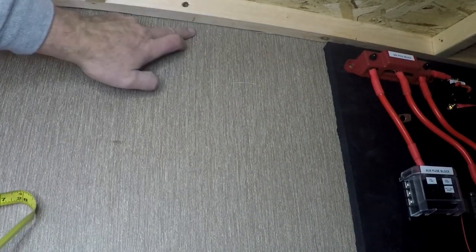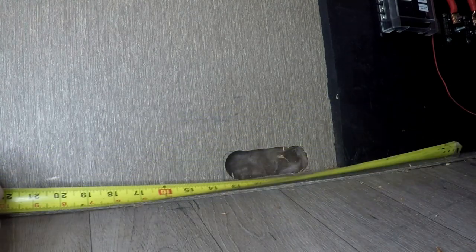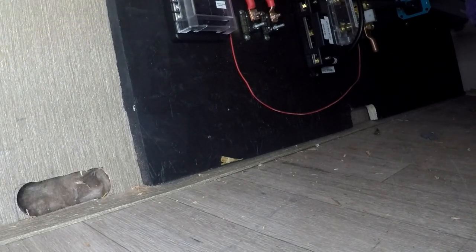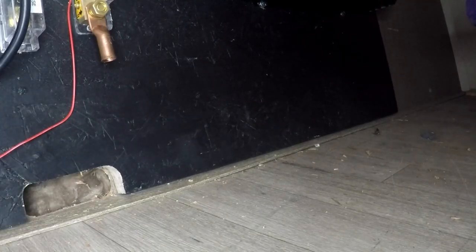Roughly 30 inches - I've got a mark right there so I can put a screw in. Running the tape in that direction, it appears they're on 16-inch centers. I've got a mark further down on 16 and then I can go back up and put another screw up there. Let me pull this board over, get it in place, and get a couple screws in it - right like that. That sunk in really good, which means I did hit that stud.